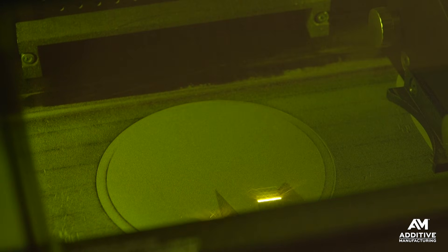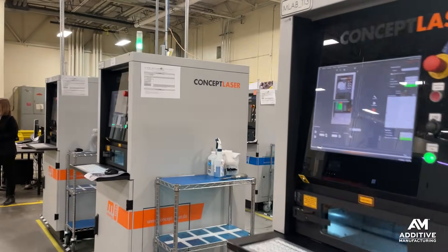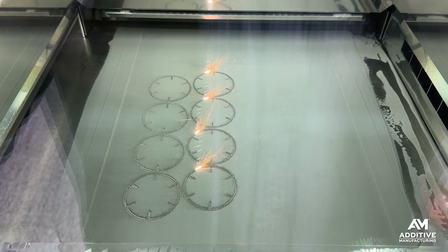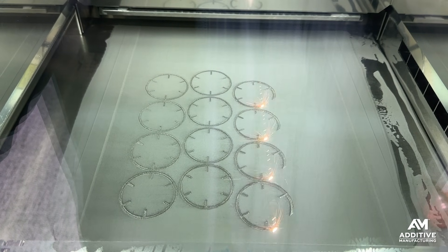Building mold tooling or other parts this way has important potential benefits. Cost savings come from building smaller parts on more affordable machines. Smaller 3D printers are also more ubiquitous, making this a more accessible option without needing to hunt down a large-format printer. There's also the potential for lead time reduction — 3D printing can save time over machining or casting, especially when you're not constrained by build volume. Plus, this strategy makes it possible to build multiple segments of the part simultaneously, whether in the same printer or spread across multiple machines at once.